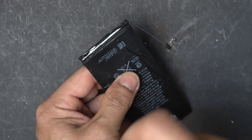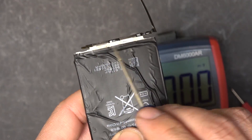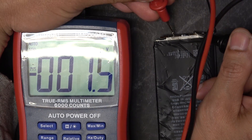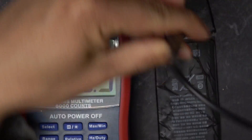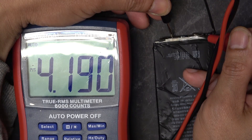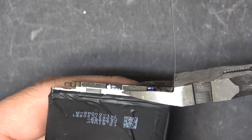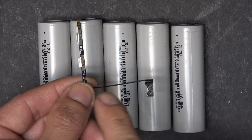The BMS has a connector attached to it and two battery terminals. I need to figure out which terminal is positive and which is negative, so I'm just going to use my multimeter. Negative 4.18 — so it should be the other way around. Now it's positive 4.19, so that is the positive terminal. Now that I know which terminal is positive, I'm going to cut and detach the battery from the BMS.